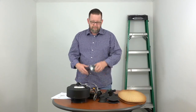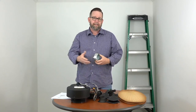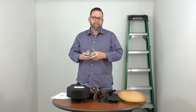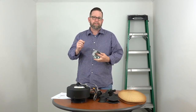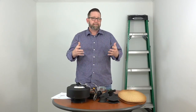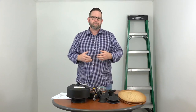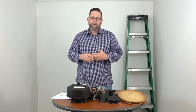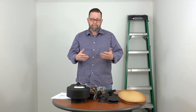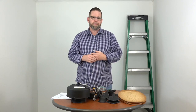A couple of notes before we get started: make sure that the outlet box is marked acceptable for fan support. If you're hanging this fan in place of a light kit, chances are the outlet box isn't acceptable for fan support — if it's thin or plastic, you'll want to swap that out before beginning. Please turn the electricity off at the breaker box and at the wall switch, and make sure those lines aren't live. If you don't feel comfortable working around electricity, call a licensed electrician.